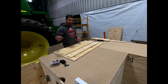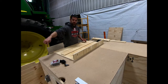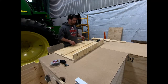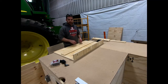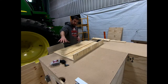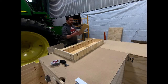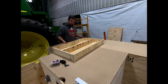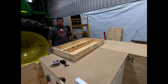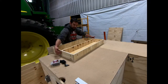We're building a platform for the table saw. These slots here coincide with the holes drilled into the wall panels, so like the bearings with slotted holes, this whole platform can move up and down about an inch centered on where I've calculated the saw needs to go. That way I can really fine-tune the saw to be exactly level with the top of the bench so boards slide through nicely. This gives the platform a lot more support than just a three-quarter inch sheet of plywood would.